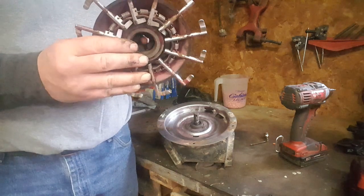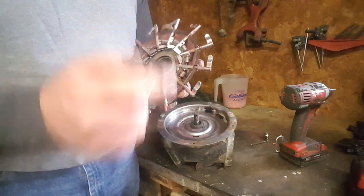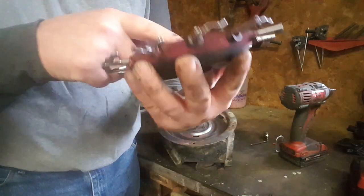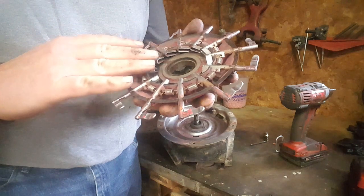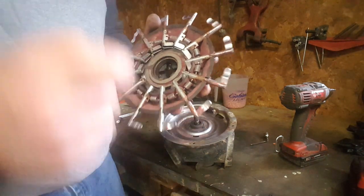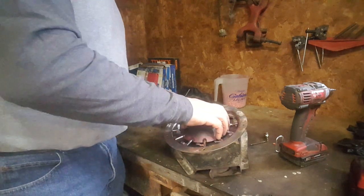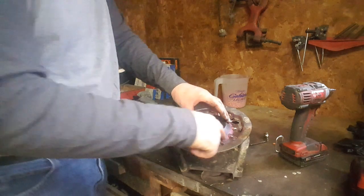The finger - here's the heart and soul of our seed meter. On the flag, what we're looking for is that every one of these springs are in good shape. Make sure every finger is free to move. At the bottom here, make sure this isn't getting rubbed through the side wall. You want to make sure they're still flat out here, that it's still a nice round tube frame. They'll actually wear flat, and that affects how well they perform.